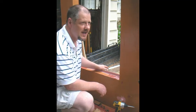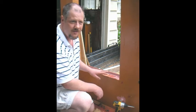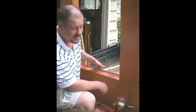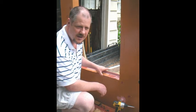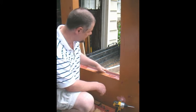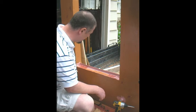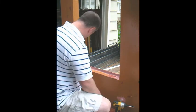There's a little bit of a debate about how much of a slope you would need before you didn't have to worry about making this vapor tight, because you would never have sitting water. I'm letting the scientists discuss that - I don't know the answer. So my approach will always be to put something vapor and water tight on the sill until I learn otherwise. I've detailed this with a joint and seam, and now I'm going to put some fast flash on to finish off that part of the detail.